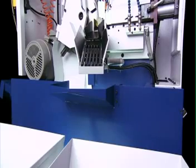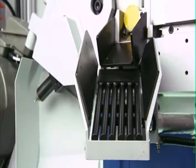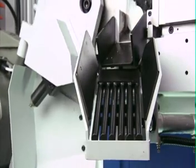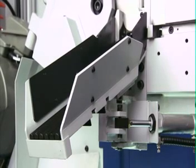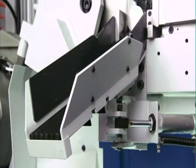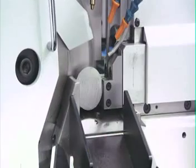One of the special production features of this machine is that during long cutting cycles, the head and tail pieces of each section can be automatically separated from other cut pieces by the out feeder, which directs them into an alternate hopper for recycling or disposal.